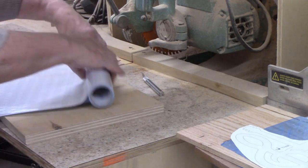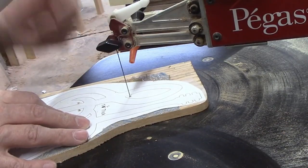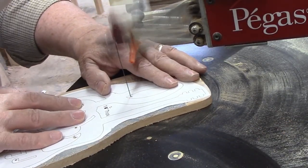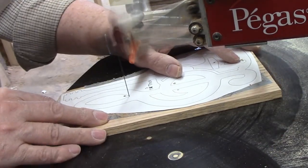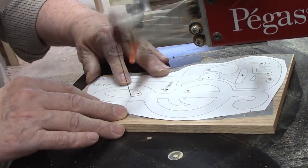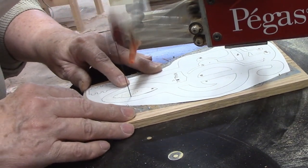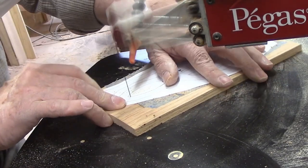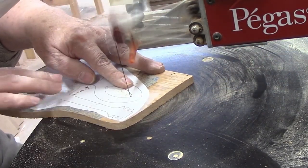I'll need to take those to the drill press to drill pilot holes for all the interior cuts. I'll start cutting with the top layer, the one with all the detail. This is one half-inch thick red oak, and my experience tells me I should use a number five blade. I based my choice on the thickness of the wood, the hardness of the wood, and the complexity of the pattern. I'll leave a link to my video on how to choose the correct blade size on the screen and in the description. The Pegas modified geometry blade is my go-to series of scroll saw blades, and I'll leave a link to my source in the description.